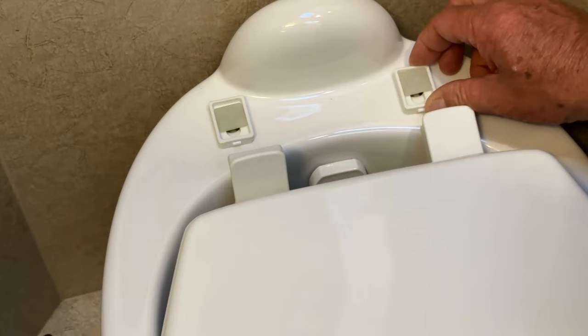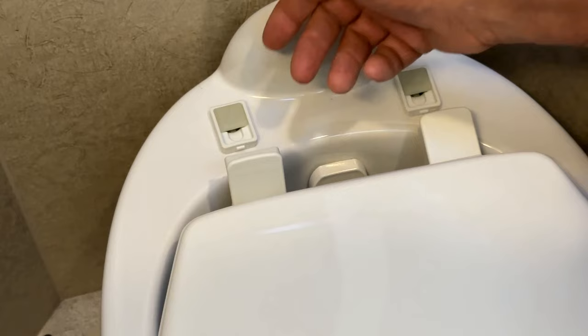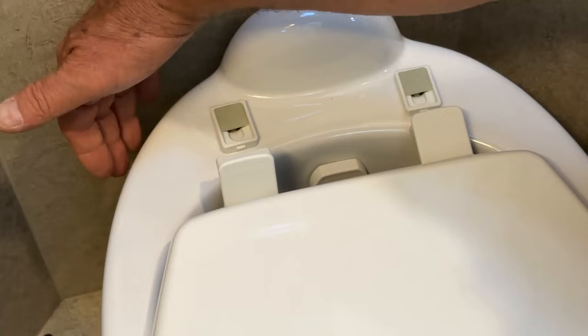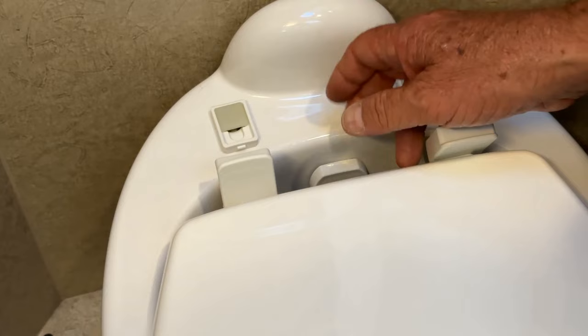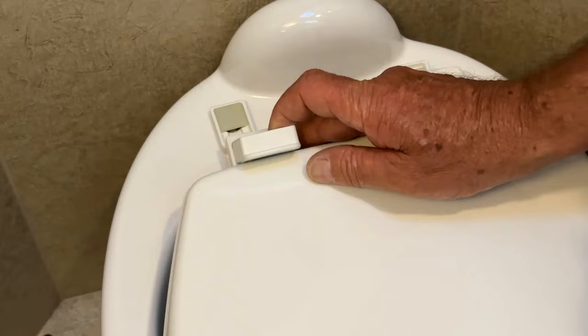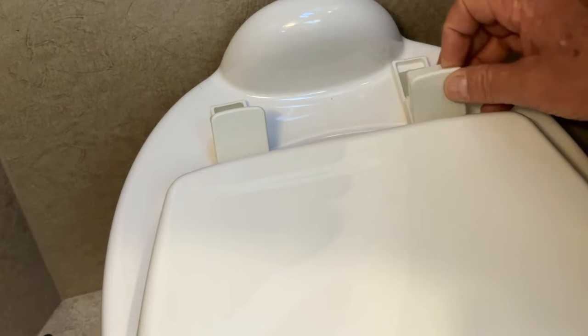I got these loose — it's really difficult to reach under there and get it started, but you can do it. The trick is to use that socket setup to reach underneath, or maybe even place a mirror underneath so you can see. If you have a hard time, you can always take the toilet off — there are a couple of bolts — and pull it out to do it. Now for the fun part — these should slide right into place. You never know if it's going to be easy or hard.